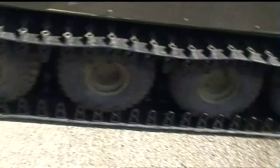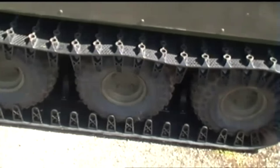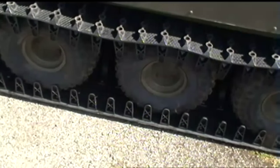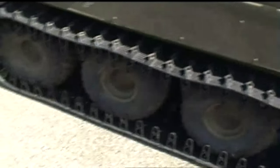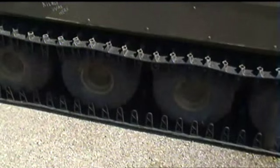I'm going to have a little bit of a look on the internet, see what tyres I can find. There's a few on there, but I just can't make my mind up at the moment. America seems to have a lot of tyres. I've even been looking at the sand tyres. Now, sand tyres have basically got very few ribs across them, probably about 8, which isn't very many, and they basically just run straight across the tyre from one side to the other, most of them. But they seem to have a problem in that they've got a scoop on them, so they're only going to grip properly in one direction. So when I try to turn it in reverse, it's not going to work again, it's just going to jump. So they don't seem to be a good idea.